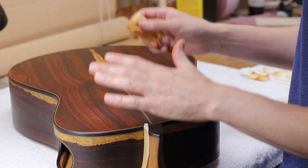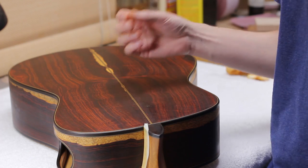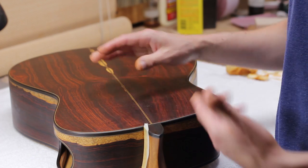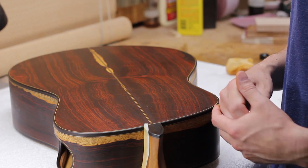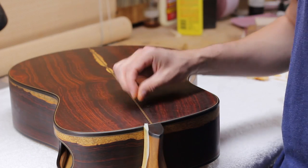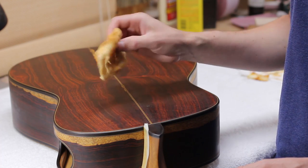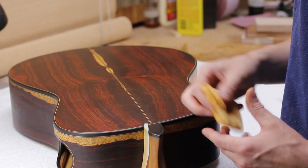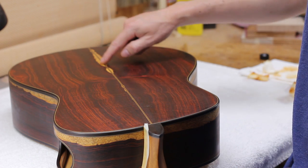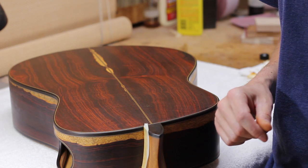The specific critical trick is: when you're working with resinous woods like cocobolo or lots of rosewoods, what do you do when you have a really resinous wood that has tons of color? You can see how much color is in this cheesecloth, and there's a lot more than that when you first start out — there's just color everywhere. How do you keep these maple purfling lines or sapwood clean? I'm going to show you a little trick I use to go back and clean that with no sanding and no fancy stuff.